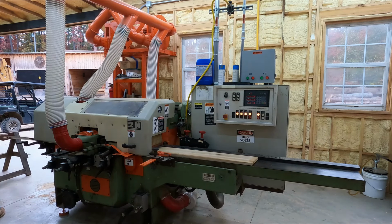I measured these boards and they're 0.751, 0.498. And you lay a tape measure on there, your eyeball can't see that 10 thousandths difference. But we're shooting for as close as we can get, perfection. You always gotta have a little variance, it's wood.